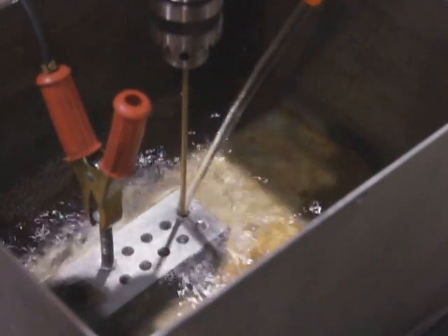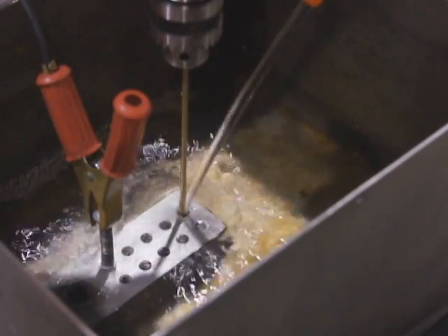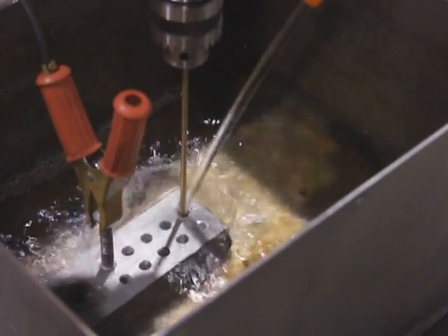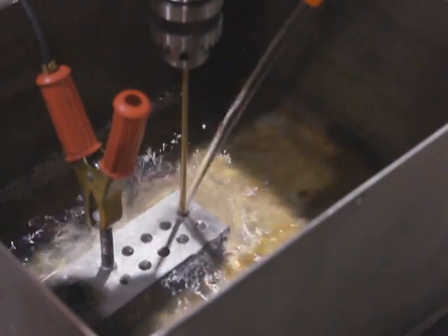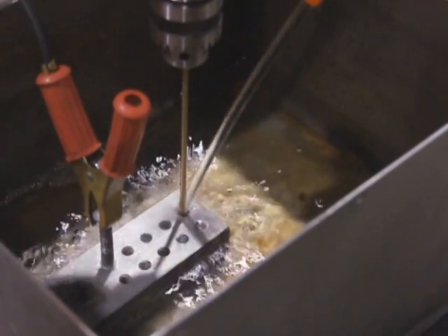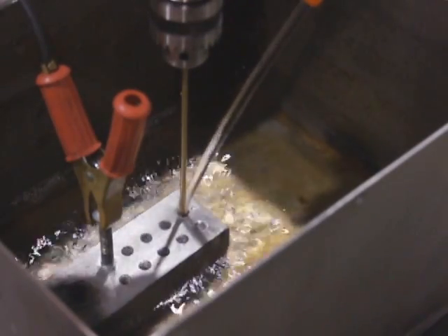For flushing, there are a couple of different ways you can go about flushing with your TR-100. The easiest way is with just a constant flow over the top of the workpiece. This can be done on small parts and especially larger parts that are harder to submerge. The only downfall to this is it doesn't drill quite as fast, and as you start burning you get a little bit more splash up from the arcing.